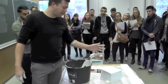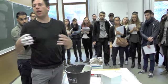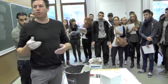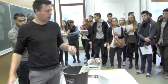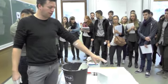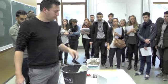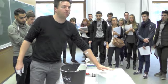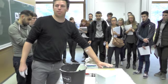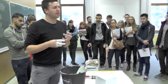Models like this more or less take about six or seven days to fully dry. But then it's really completely dry, because after three or four days you're going to think it's dry, but on the inside it's not really dry — so it takes a bit longer. Within an hour or two, models like this you can already demold. You're going to feel it because it's a chemical process — it's going to get very hot. That's because the water and plaster are mixing together chemically and making themselves strong.